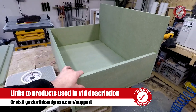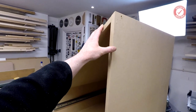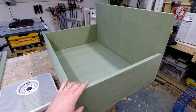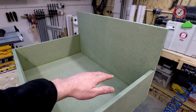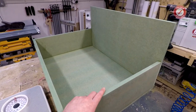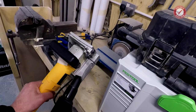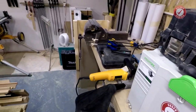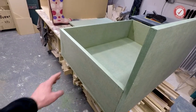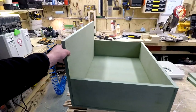It's pinned and glued with Titebond Type 2 and screwed together. The drawer box itself is MR-MDF — moisture resistant — because you'll potentially have damp shoes going in there. I've got loads of non-MR-MDF to use up and for the framing liner that's ideal, but the drawer box does need to be moisture resistant. It's 18mm three-quarter inch MR-MDF, biscuit jointed with the trusty DeWalt biscuit jointer, then pinned just to hold it while the glue dries.